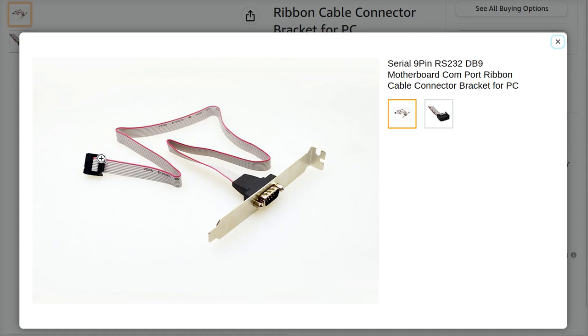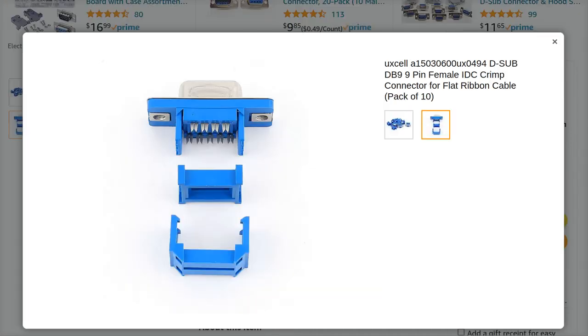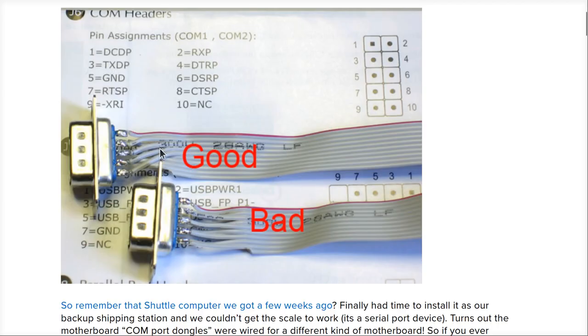In this zigzag up and down arrangement, the pins would match the zigzag up and down arrangement of the pins on the D sub connector, because that's how all insulation displacement connectors work, as they go back and forth, back and forth, back and forth like that. That is the entire reason ribbon cable was designed. It was intended to be used this way. It was designed so that people do not have to solder all the wires on the connectors, inhale the fumes, and then die of cancer, et cetera, et cetera, et cetera.